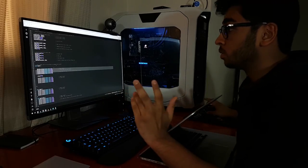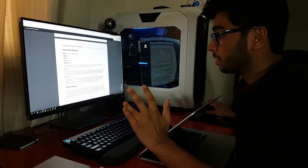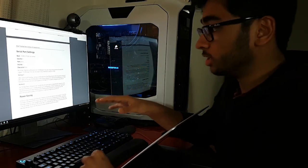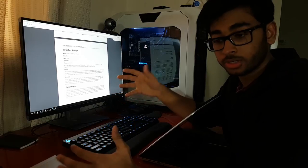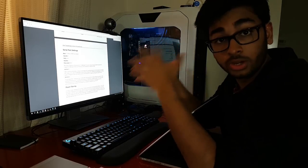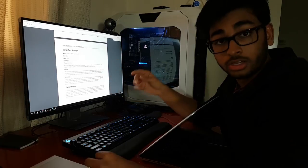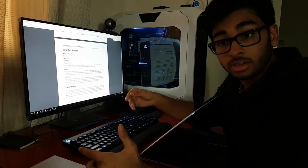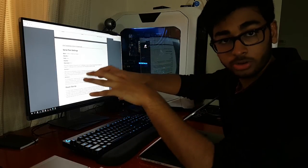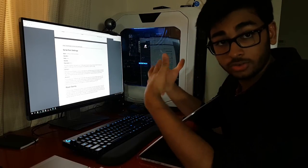What I realized was that the Create automatically starts communicating at 115,200 baud. So, for those of you who thought I was speaking Chinese for a second, serial communication between microcontrollers and computers is much like communication through radio waves. There are different frequency channels that you can communicate through and send your values through. Here in serial communication, you choose a baud rate, and the receiver and the sender, like the two parties involved, must be on the same baud rate to be able to exchange information.